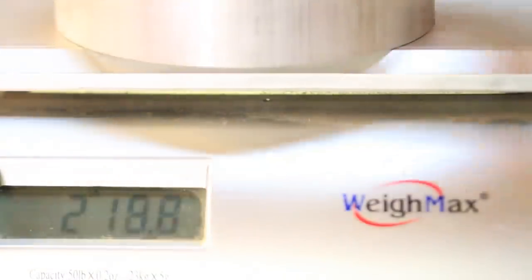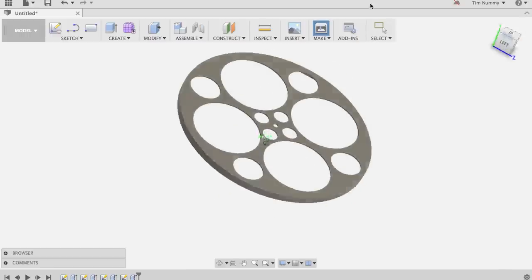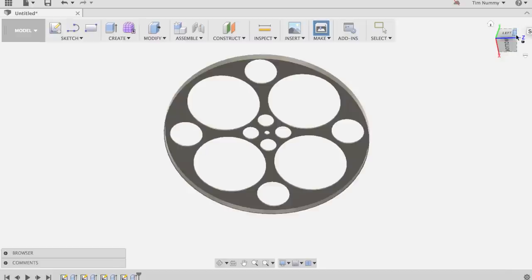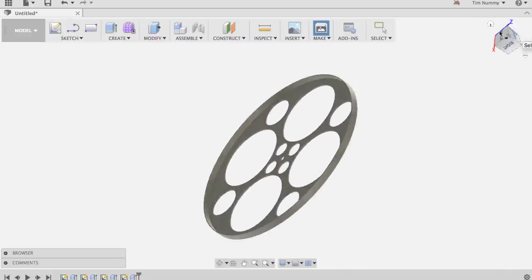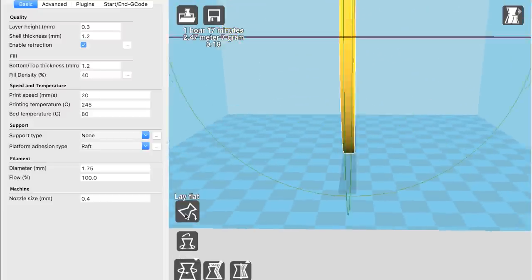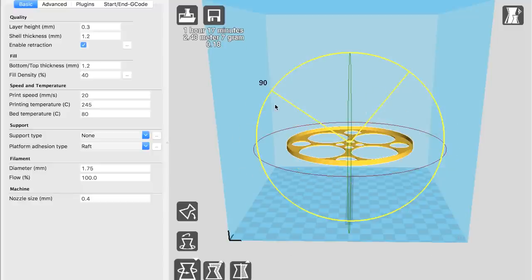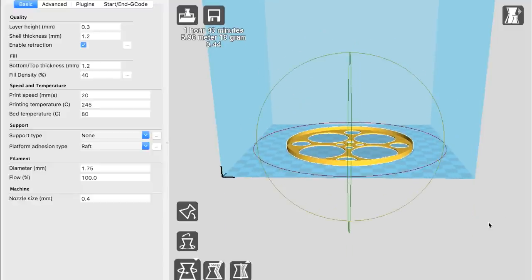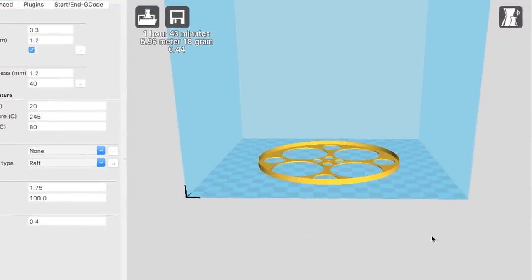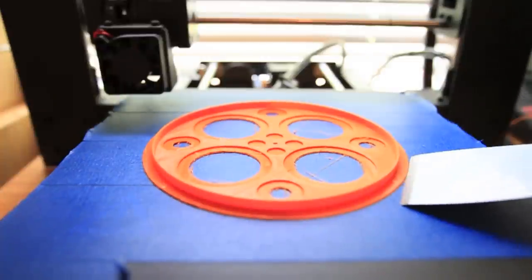With this piece of aluminum weighing in at almost 3 pounds, it was critical that it had to be centered, as any off-center mounting would result in pretty aggressive wobble and could potentially be very dangerous. So I modeled up a centering tool to be able to find the exact center of this 5-inch diameter aluminum with relative ease.